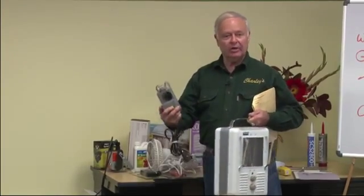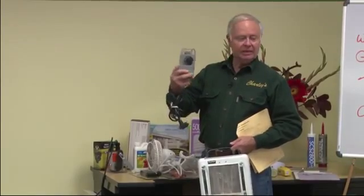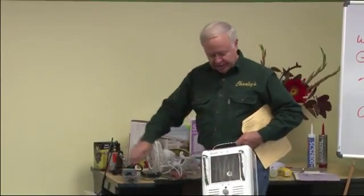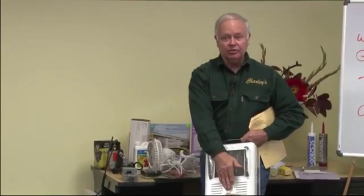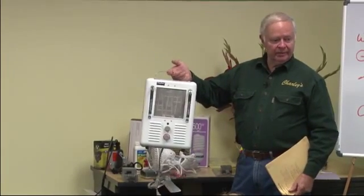You can plug the power cord of your portable heater — any heater — into this external thermostat. Set the thermostat on the heater to high so the circuit stays closed; the heater is always on, but the external thermostat will turn the power on and off. That's only a 1,500-watt heater — that's all you're going to get on a single 120-volt line.